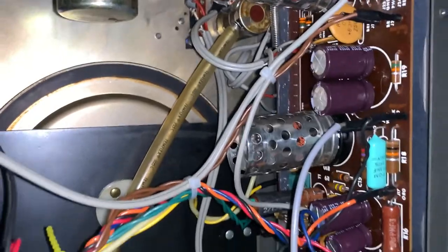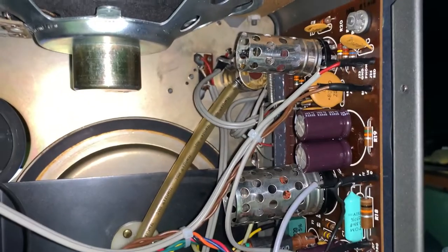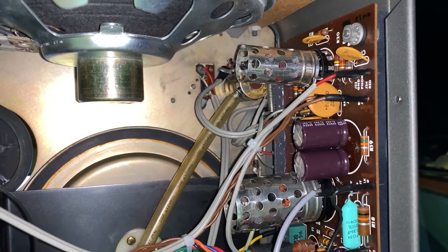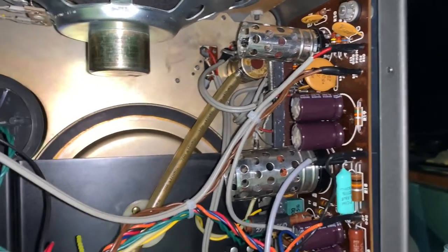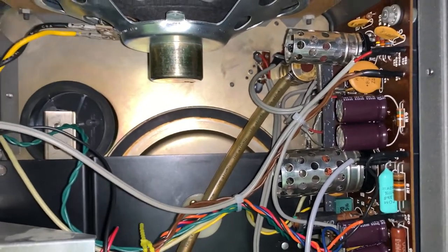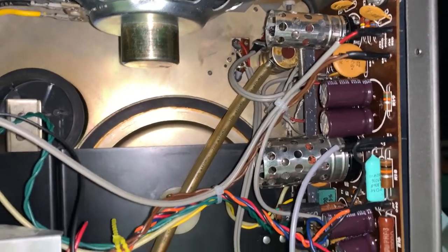I tested the tubes — determined the final amplifier tube was fine. When I pulled the preamp out, it's when the preamp was in that I had the hum in all modes, even on line in. Out of frustration, I found the problem. It always seems to be the case — always something stupid that's not obvious. I don't know why it would make any difference if ground was connected or not up there since it's the same connection point, but it did, and I fixed it.